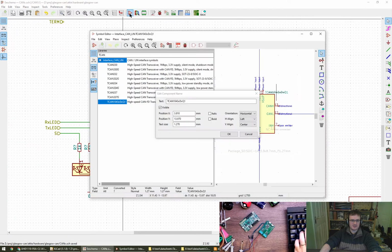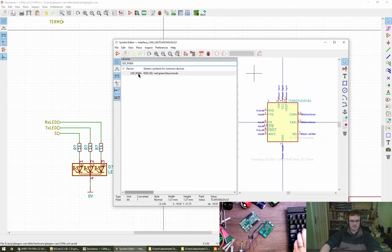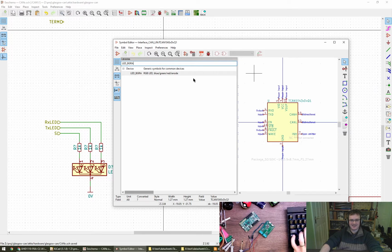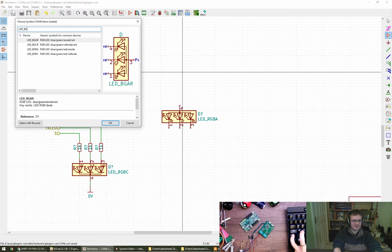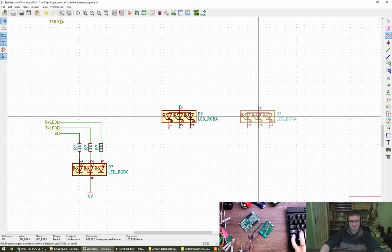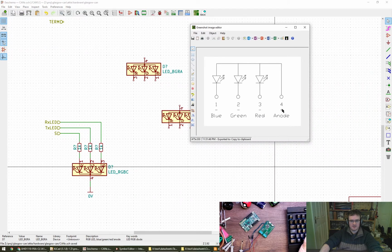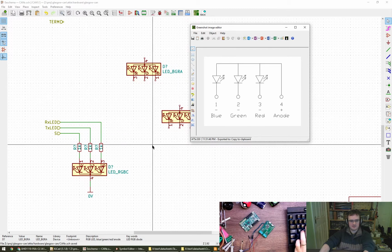New experience for me, at least. LED, RGBC, I think it is. RGBA. Never remember these things. Save a copy, duplicate. Oh, you reckon? BGRA. Hey! Okay. Sorry, Rachel, didn't see. LED, BGRA. And A is not for alpha in this case. I have to be careful of that one. So the dies are still laid out RGB, but the pin numbering is different, and that looks like it matches up. So blue is 1, green is 2, red is 3. There you go. Very good. Thank you.